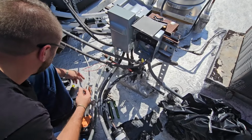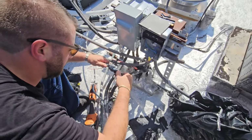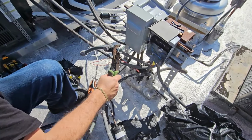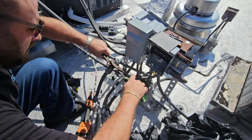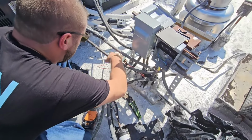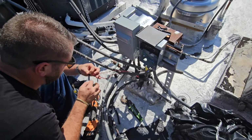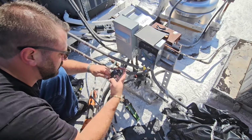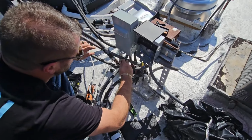This is the new EMT male adapter compression fitting that will slide right over the old pipe. The old pipe's in pretty good shape, so this should go pretty smoothly. I'm just going to put a quick wrap of tape over the old stripped ends because they're a little bit snarled and will get snagged on the inside of the liquid tight conduit. This way, I can't cut them short now and restrip them so they'll slide through nicer, because I don't want to make it too short. I want them to be inside the disconnect before I restrip them to make sure they're long enough still.